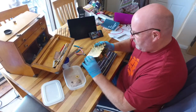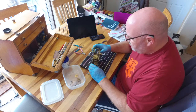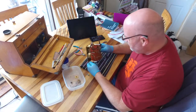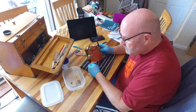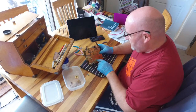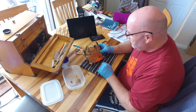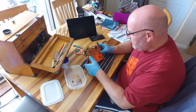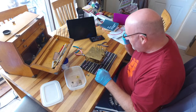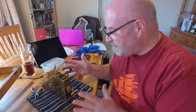So we've got it back together again. It was a bit of a mission to get it all in, get all those wheels back in one place, but she's back together. So now, the next job for this is to cut some new click wheels for it. I replaced the one on that side for the strike, but these two click wheels were worn as well, and I thought I'd get away with them, but I didn't. So I'm going to cut new ones for that. And then it's just a question of working out how — setting the chime mechanism and strike mechanism back up again, so that it chimes on the quarter of the hour.